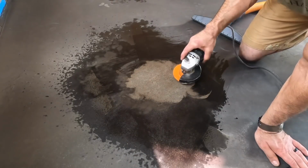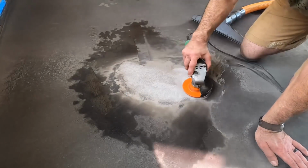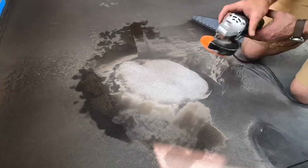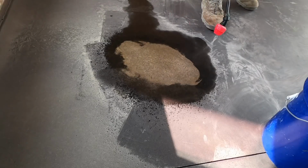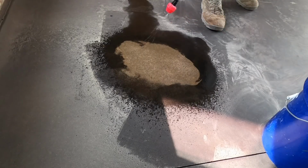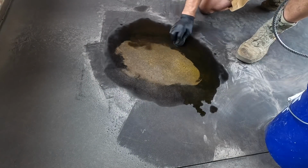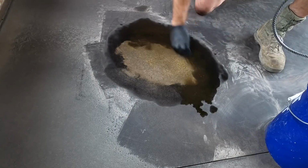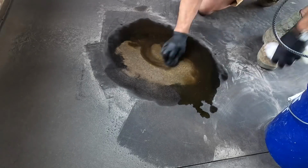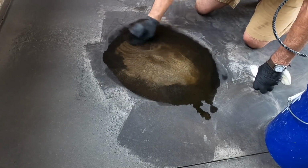Since I had a technique that works for removing the adhesive foam from the cement, I went through and cleaned up the other areas that were bothering us. I used a light concentration of muriatic acid to help loosen up the bond of the stain with the concrete. A very aggressive brush and sponge, and I was able to blend the edges after about 20 or 30 minutes of the muriatic acid sitting there. Again, that was a 1 in 20 solution of muriatic acid.